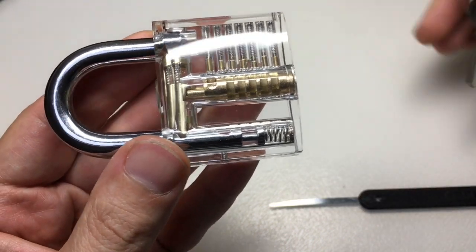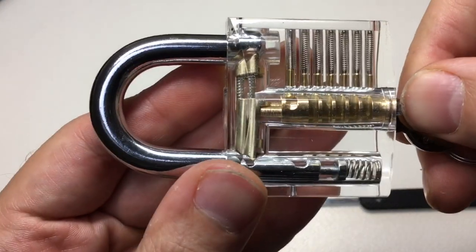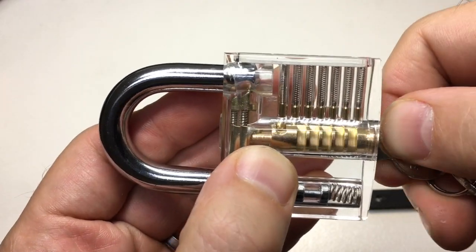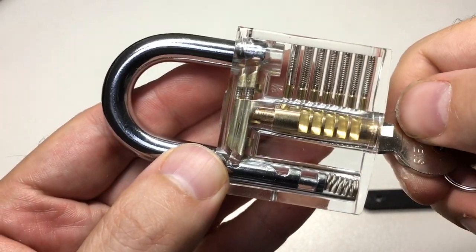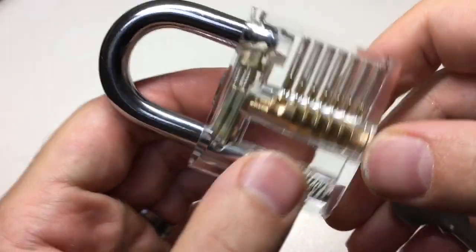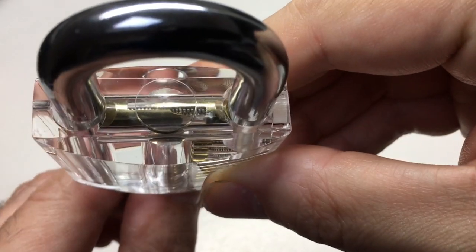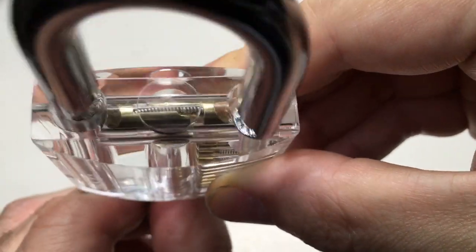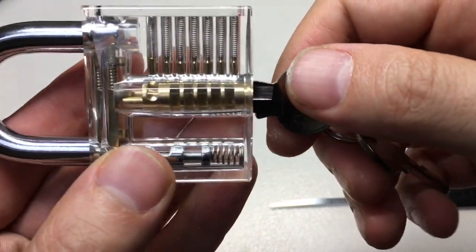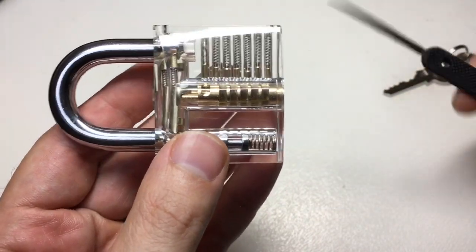So when you take a key and you put it into an unshielded padlock, we'll talk about that in a minute, you can see that the pegs at the back, or the actuators at the back of the plug, rotate, and they are pushing the locking pawls that hold the shackle in either side apart. There you go, you can see it turning. So the locking pawls have a spring between them which pushes them both apart, and you have to turn the plug to open the lock. It kind of makes sense.